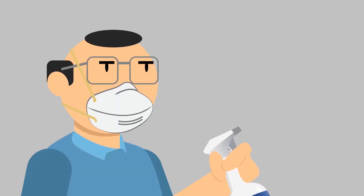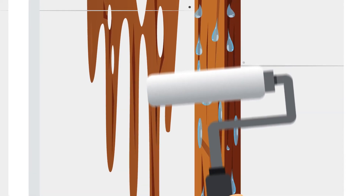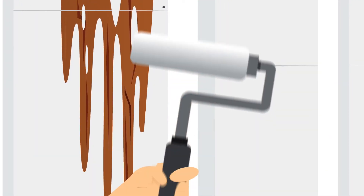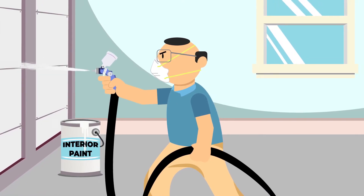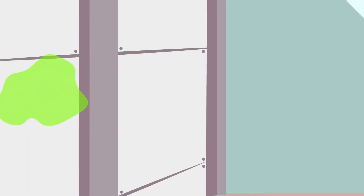There's one last word of caution: never apply the paint over wet building materials. If the lumber is still wet, either from active water damage or the application of antimicrobial products, it can cause the mixture of chemicals and sediments to create hazardous off-gassing. In addition, it can also seal the wet building material and prevent it from truly drying, also leading to a potential of off-gassing.